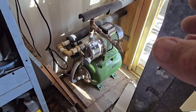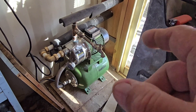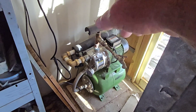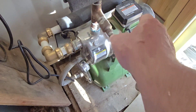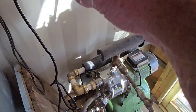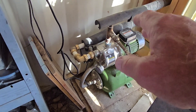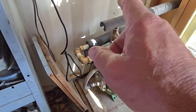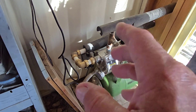Mine works just fine ever since I learned the secrets of proper bladder pressure and proper pipe sizing. You've got to have one-inch pipe — you can't do it with three-quarter inch at the pump. After the pump you can reduce down to three-quarter going to the cabin and then to half-inch going to each faucet, that's fine. But at the pump — coming in and going out — those are one-inch connections. You have to use one inch; don't use a reducer. You will not get proper pressure readings if you do.